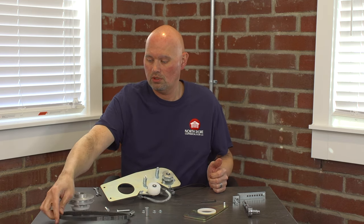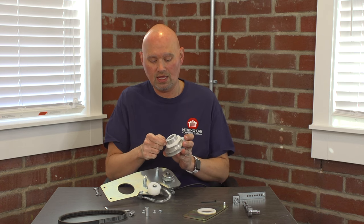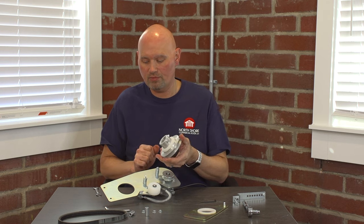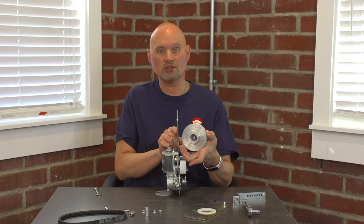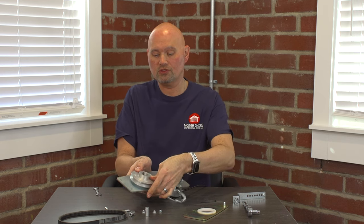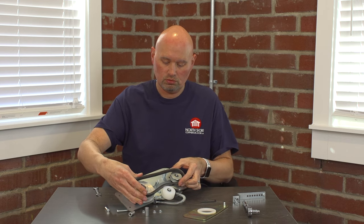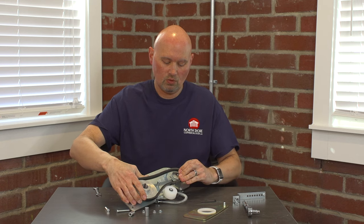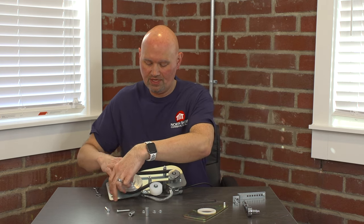Now place the drive pulley back into the motor assembly plate. Get your set screws back in — you can leave the nuts loose around them for now. With the set screws back in the collar, that will prevent the bushing from sliding off as you reinstall it. Make sure when you reinstall the drive pulley that the set screws are on the same side as the motor gearbox, with no set screws on the opposite side. It's always a good idea — especially if you have an older or different model — to take a photo with your phone before disassembly to ensure you're getting everything back exactly as it came off.